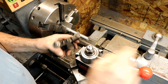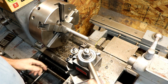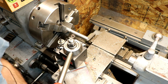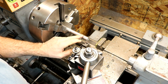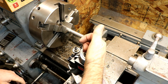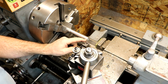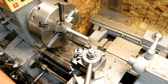One thing about carbide inserts: when you're using them and you make your cut, if you back-drag that and there's enough pressure of the tool against the work, or if you have not used the tip of pulling back and relieving that pressure so that the cutting edge does not drag on the work, you can very easily chip your insert coming back on it like that.